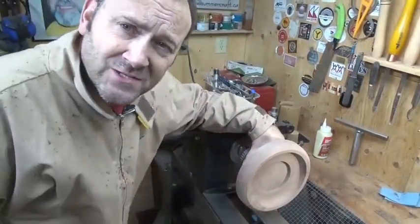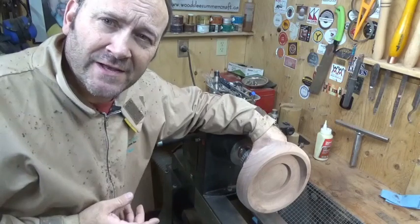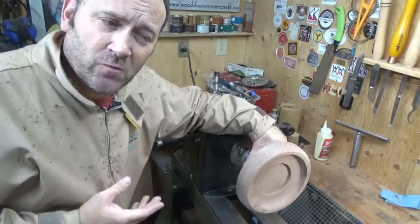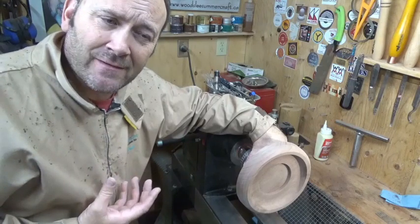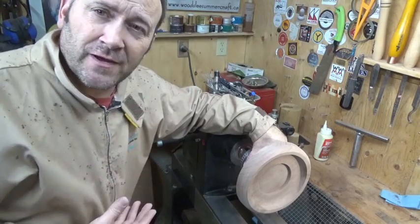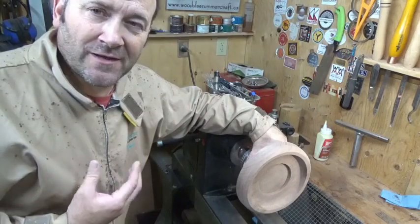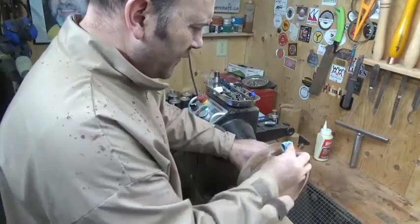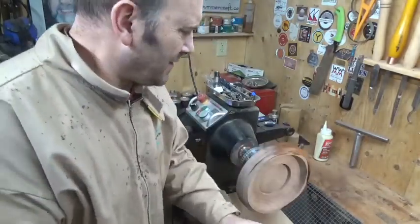Okay, so this is sanded to 100 grit at the moment, and quite often what I'll do is I'll wet sand using oil, but this particular piece I feel like I'm going to finish it with a spray lacquer followed by Yorkshire Grit and Hampshire Sheen, so it's going to be really glossy, like super glossy. That's the idea with this particular piece. Already seeing the beauty in this piece of walnut. I absolutely love walnut.